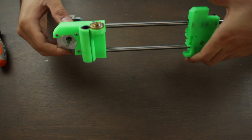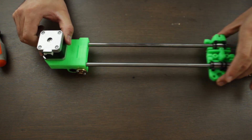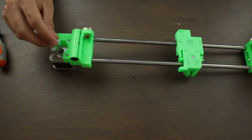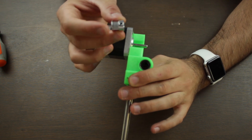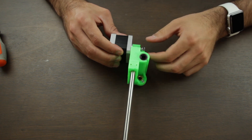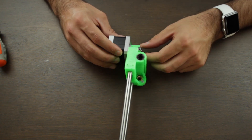As you can see here, the motor is properly attached to the structure and the carriage can move smoothly without making any vibration. The next step will be to install the GT2 16 pulley, and we are going to do it in this orientation. Once inserted, you have to align one of the little screws on the flat side of the motor axis, and before tightening it, we are going to install the GT2 belt so the pulley will be perfectly centered.